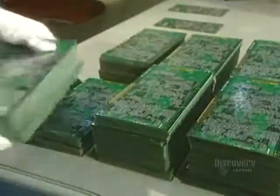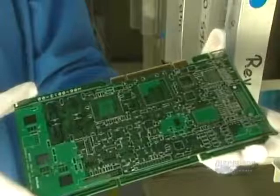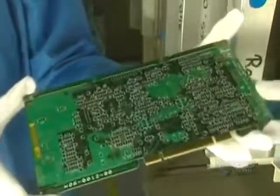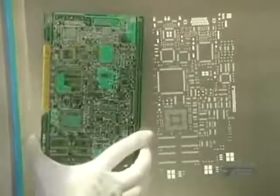A printed circuit board can be compared to a building composed of fiberglass floors, copper passageways, and stairs that link the floors between them. Cards are assembled with two technologies, surface wiring and wiring through the card. The components are placed into the holes and soldered into place.